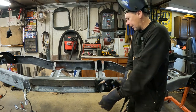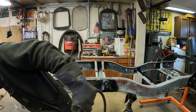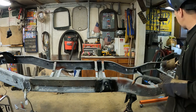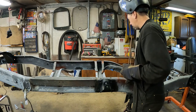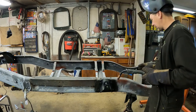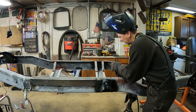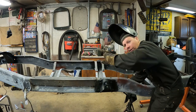After I hit it with the welder I think that's going to wrap it up for this video. I'm real close to getting this thing ready to paint. I've just got to rotisserie it around, finish my welds on these pieces, and then all the welding will be complete. Actually I've got to weld back at the trailer hitch just a touch back there. But all the bottom welding will be complete. I'm going to rotisserie this thing around, paint it with Eastwood Rust Encapsulator, and then we should be ready to assemble — put the springs on and all the fun stuff. This frame is a little bit rougher than I thought it was when I started, so it's taken a while to get her dialed in, but it's dialed all the way up to 11 now.